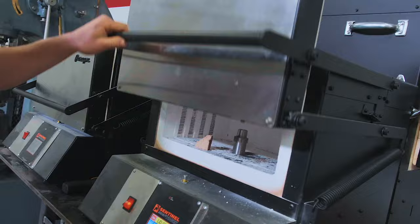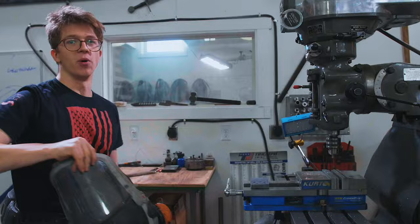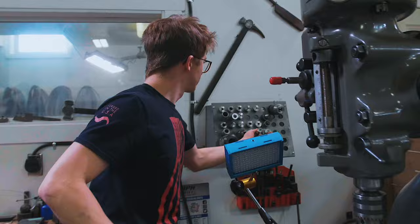At the end of yesterday, this is where Will left off on the Beskar Steel billet — he's got some patination going on in there by making some little divots and dents. I'm now going to come to the mill — this beautiful Bridgeport mill — and we're going to hog off some material with a face mill. Short of sawing and drilling, there are few things that remove as much material as a nice two-inch face mill with four indexable carbide inserts. We're going to hog so much stuff you'll think we're roasting a pig.